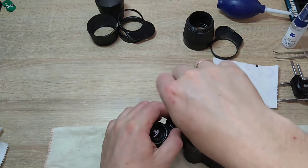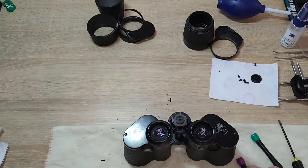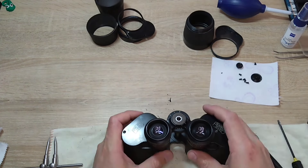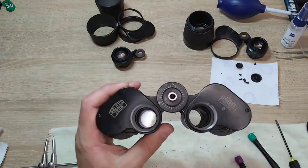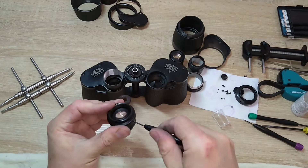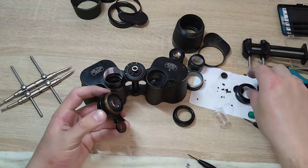Next, we try to unscrew the lenses. First, we unscrew in the middle. Then there is a locking screw here, very, very small — it needs to be unscrewed carefully. And then, using this kind of tool, unscrew the clamping screw. Now, carefully lift the right lens and gently lift the left lens. Place them accordingly on the left and right. This one manufactured the parts very precisely. The left lens has one screw specifically, while the right lens has three clamping screws respectively.